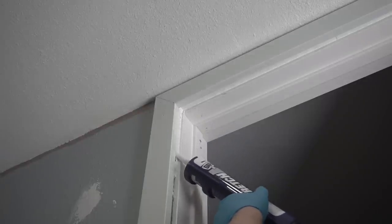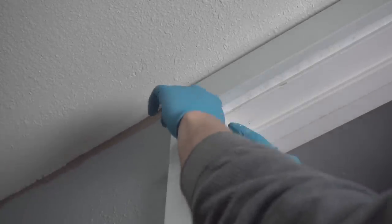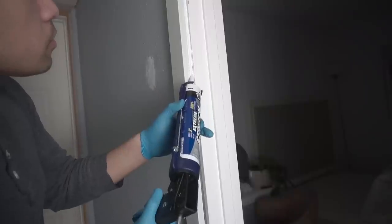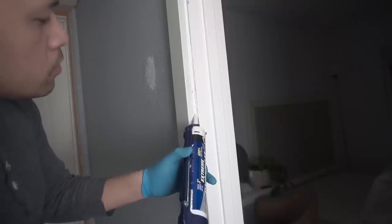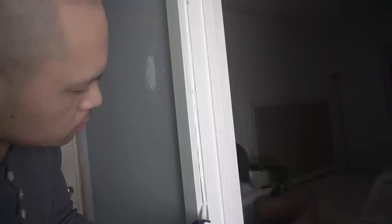Do the same thing on this side. If it falls short and you have voids, take your caulking and refill those voids — make sure the caulking sticks out enough so you have enough to screed off. Use your left hand as a guide, put pressure on the left side touching the MDF, and run your putty knife along that line. We're just repeating the process — putting caulking over the backer rod so it's nice and even.